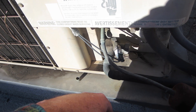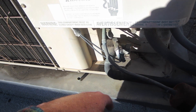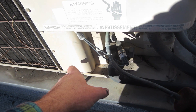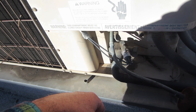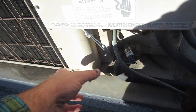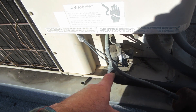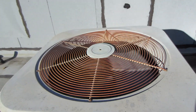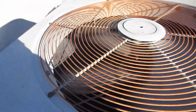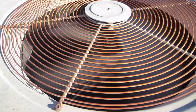But by Monday it's going to be 80 out, but it's still going to be cold inside. So the outdoor unit is going to pick up too much heat and trip that high pressure switch. I'll show you what happens when it cuts out.